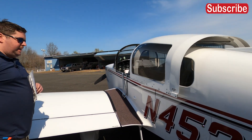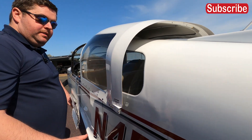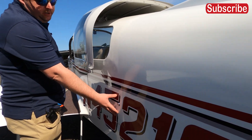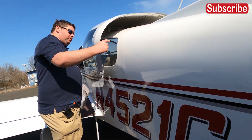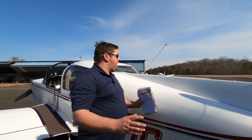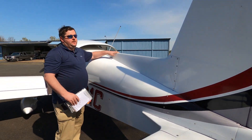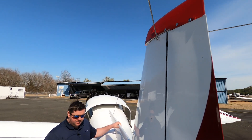Making my way back to the left side fuselage. Much like the Cessna, your baggage door is right here. The door access is smaller, but you actually have quite a bit of room in the trunk — you can store up to 150 pounds of baggage, which is cool. Making my way back to the tail, checking all my antennas to make sure they're in place — the navigation antennas, the V-shape up top, similar to the Cessna.